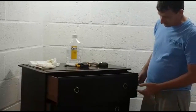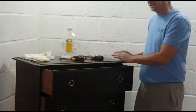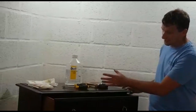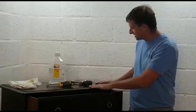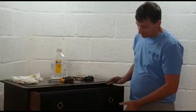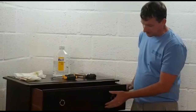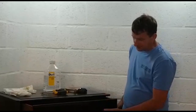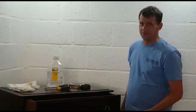What we're going to be doing here is taking the door furniture off and giving it a clean, ready for its coat of Zinsser, which is the sealer coat, which basically obliterates this sort of mahogany stain and annihilates any risk of bleed through of yellow stains and stuff. If you use the water-based, you will probably get some yellow stains coming through, and we don't want that.